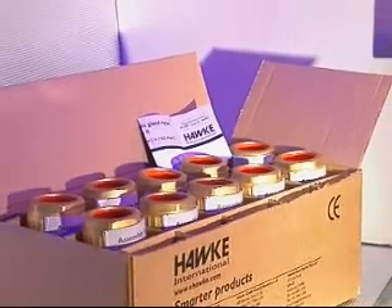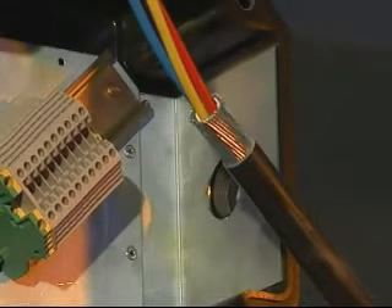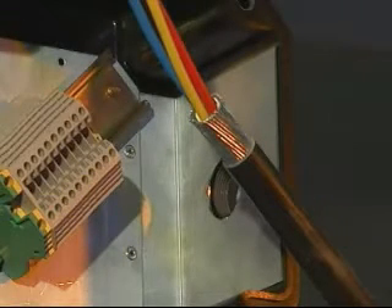Please refer to these for further instructions on cable preparation and installation. Cable preparation ICG-653 Universal, ICG-653 Dedicated armor and ICG-623. Allow sufficient length of cable to enable termination of the conductors into the junction box. Strip back and remove the required amount of cable sheath and armor or braid to enable connection to the terminals. Remove the inner sheath level with the armor or braid to expose the conductors.